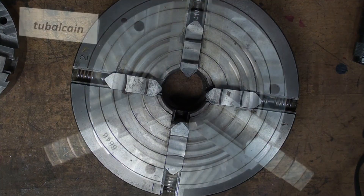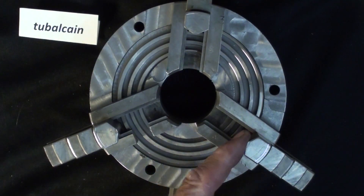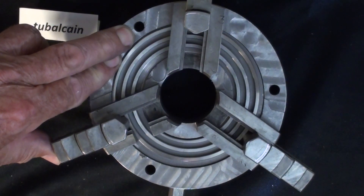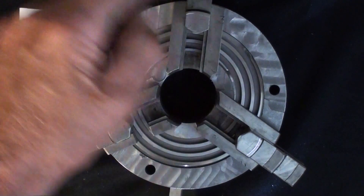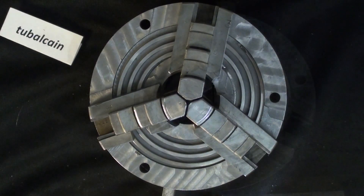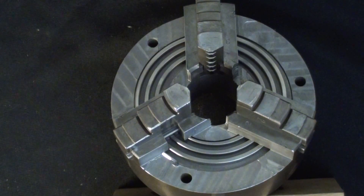Compared to the scroll, this is fast and semi-accurate; the four-jaw is slower but you get a lot of force, especially on very large chucks on large lathes, and more accurate — you can get it within half a thousandth or even closer. These are jaw one, jaw two, and jaw three — they must be assembled in the appropriate slot, also marked and numbered. By watching closely, you can see why you have to assemble these to the end of the scroll, then they come in one at a time — jaw two, then jaw three. If you are out of sequence, the three jaws will not come together. Hope you liked the video — this is Tubal Cain saying so long for now.